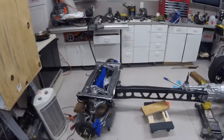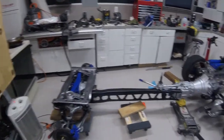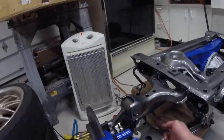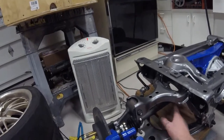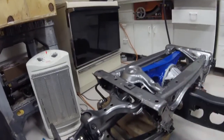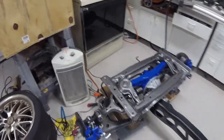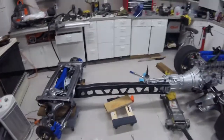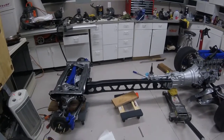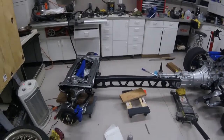So still got the rear tires to loosely mount and go through and check a couple other things. But I also got to put the rear blocks of wood in here in order to keep the rear subframe from collapsing out of the weight of the differential. But other than that, the driveline and power plant frame are officially installed, and we have a roller skate again, pretty much.